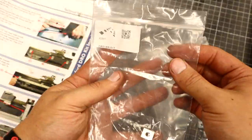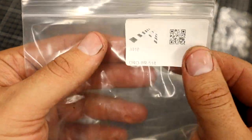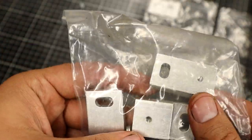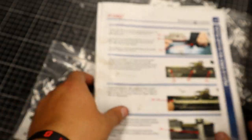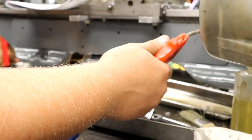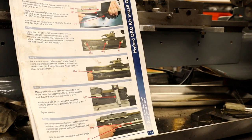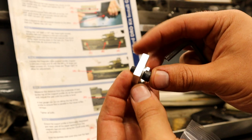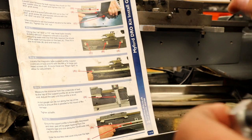I don't say this is going to be a guide, but my bags look like that — which is that number there and that number there. The next bag you're going to need is this one here, and you're going to need the cap heads and these to then bolt onto the bed just here. Those look like a 3/16th Allen key head that you're going to need. The next step, we're going to put these tabs on here, and there's not a lot of thread, so don't be a gorilla and over-tighten these. Don't go nuts — there isn't a torque setting on here, so get steady.